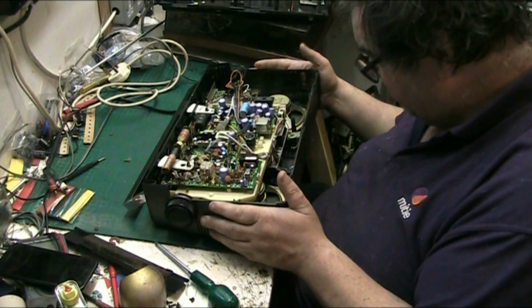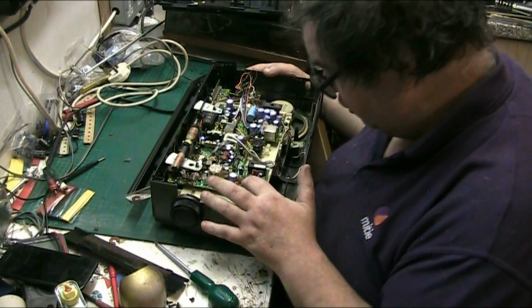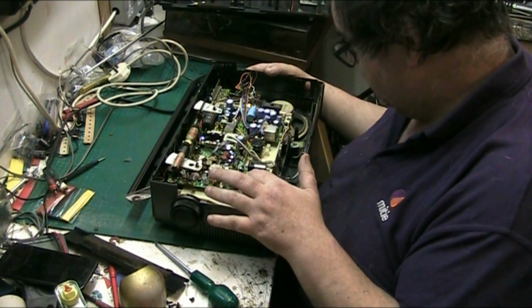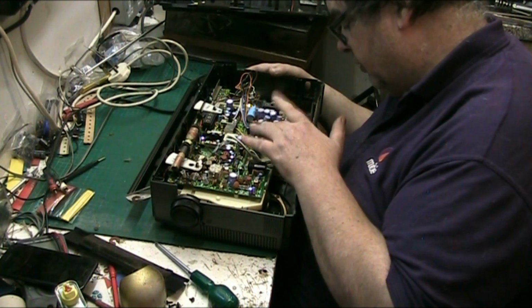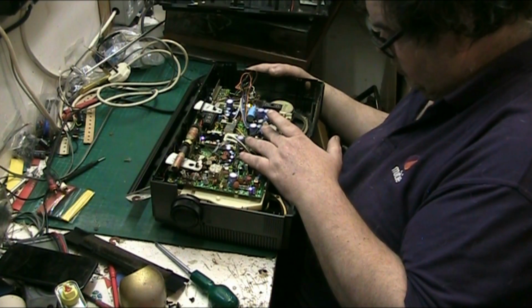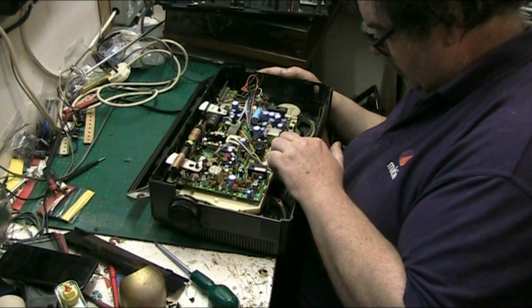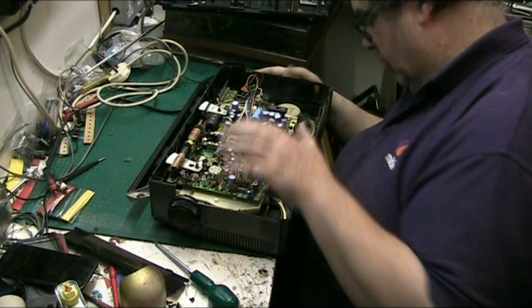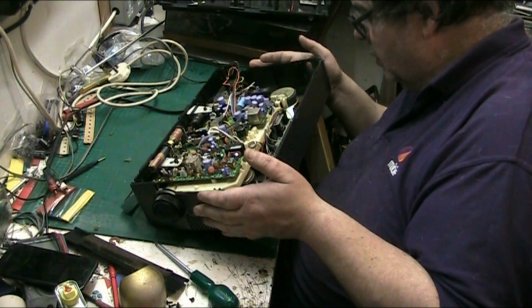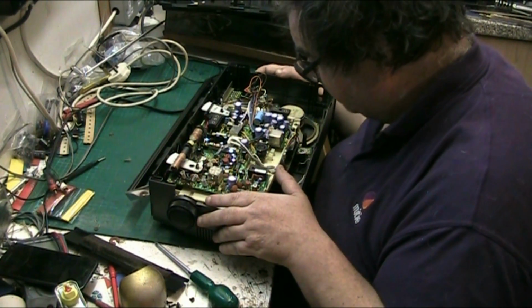I mean, how can I miss the audio amp? It's here somewhere. I reckon it's this one here, this AN. I don't know what's inside that box. Oscillator by the look of that, from what it says there, OSC. Oscillator. But it looks a bit crappy under there. Might have that conductive glue in it, so it needs a good cleaning.